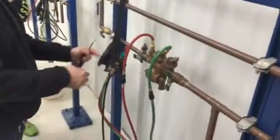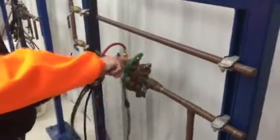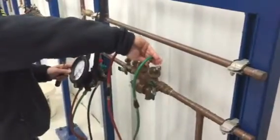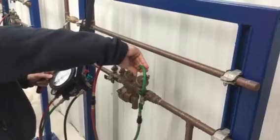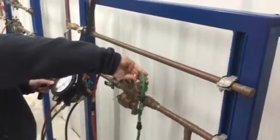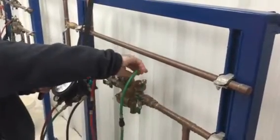To reestablish the first check, you crack that hose. Remember, you don't have that bleed valve, and you don't want to go through that entire bleed sequence again, which you could. This saves about 4 or 5 steps just by doing that.